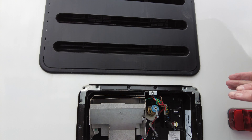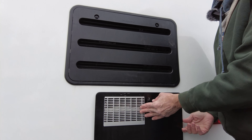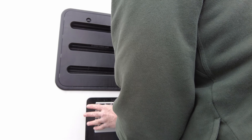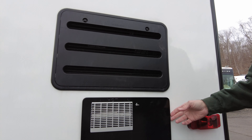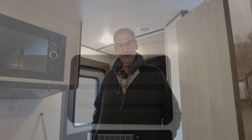You have to get that water out of your hot water heater because you're not going to put antifreeze in the heater. I'll show you how we bypass the heater entirely when we put the antifreeze into the lines. I usually just keep this plug in here — it's sealed, it's not going to go anywhere even if you're traveling. Hook it back up. This always bothers me — every hot water heater like this never fits on properly, but the plug's never going to come out.